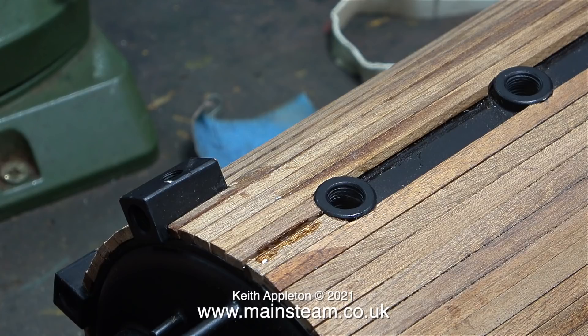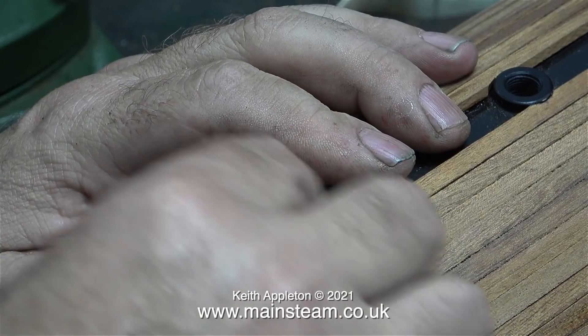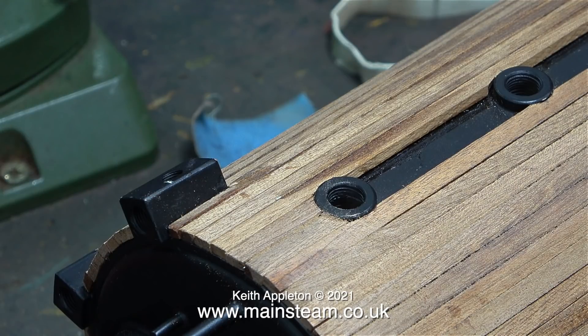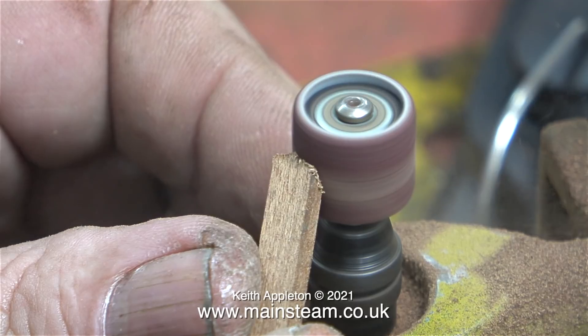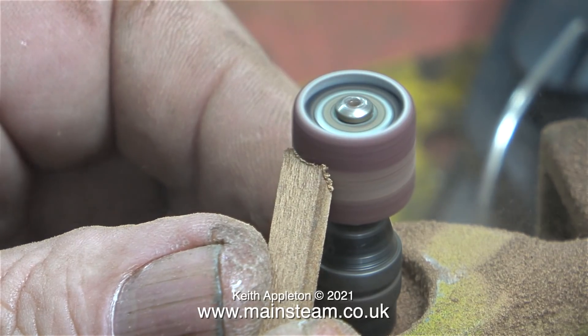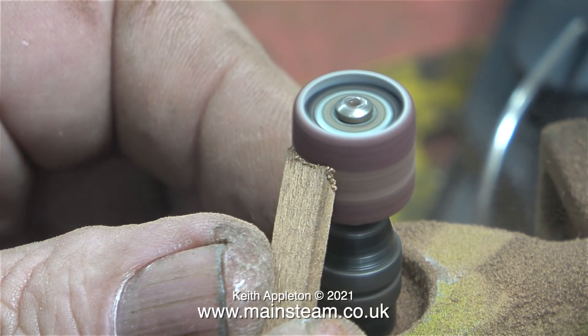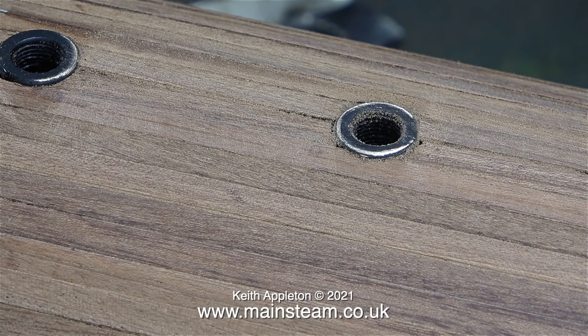Returning to the fiddly bits — the ones at the other side didn't really need much of an infill piece. Once the cyanoacrylate adhesive had grabbed, I simply sanded across the gap which filled it in perfectly. As the three bushes on the top of the boiler are much larger than the one on the side, I used a larger drum sander to trim the mahogany. You will notice that I'm holding the piece of mahogany at an angle — this is to make sure that it clears the fillet of silver solder around the bushes, which may not be obvious but is quite important. After fitting the last piece, I used a piece of emery cloth to sand it, which filled the gap.